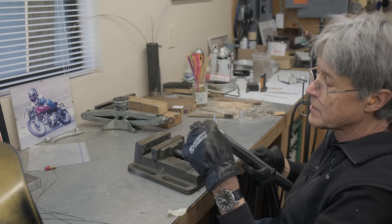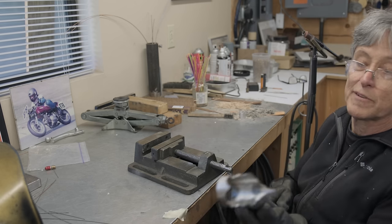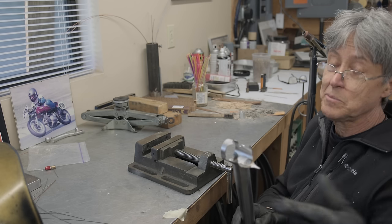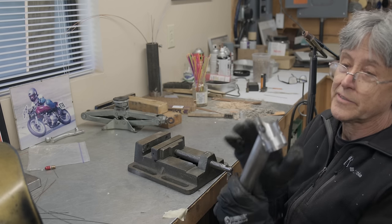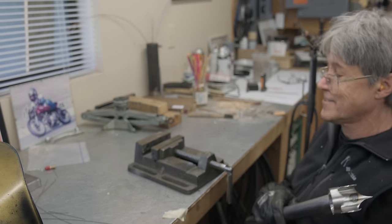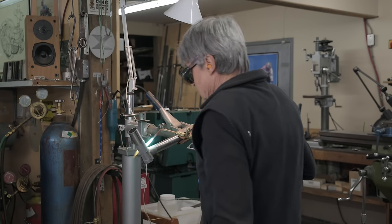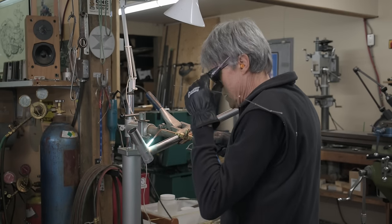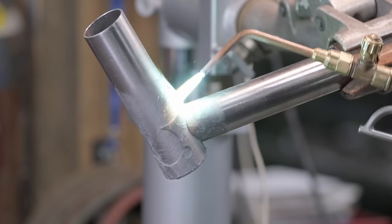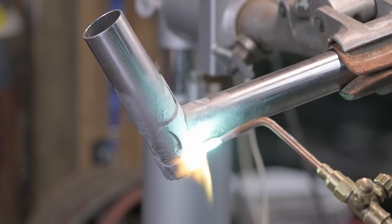And that's what it looks like. That is bilaminate. Basically half a lug, isn't it? Because the lug goes around the head tube and there's no lug on the down tube. I like that. Nickel silver rod, do a little preheat, put a little bead around, and the fillet brazing is last. We're gonna go all around the lug, the fake lug.